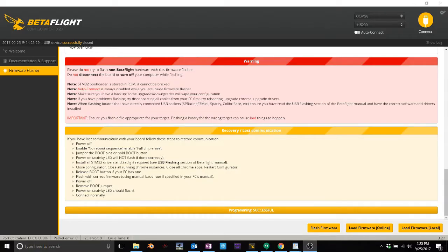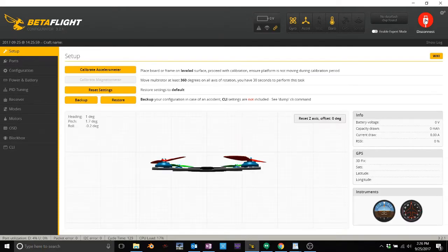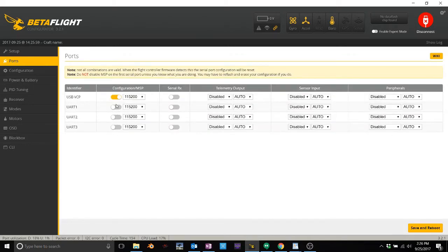Give me 30 seconds and I'll shoot over to my computer and give you a quick walkthrough on how to set this up. Okay, now here we are at the computer. Same rule applies for iNav if you're building drones, or Betaflight which is the most popular. Plug your board into your computer, connect - this is the same board I had before, I just wiped the iNav off it. What you want to do: go down to Ports, pick a UART that you're not using, and that's really all you've got to do - make it an MSP. For Omnibus you might have UART3 set for your receiver - just use UART1 or 2.